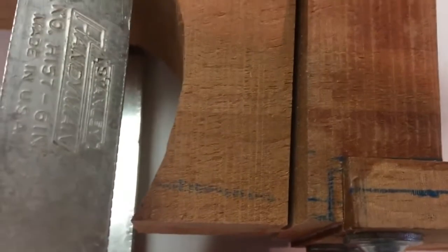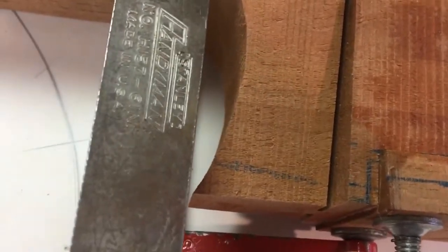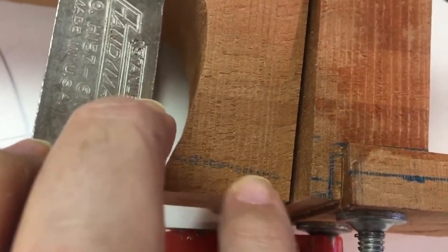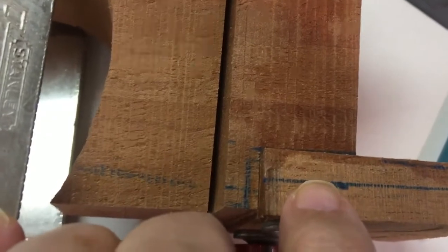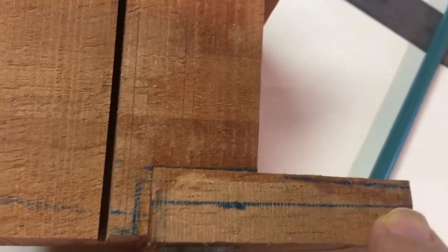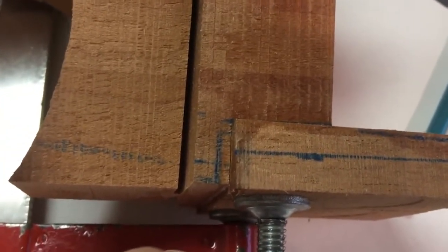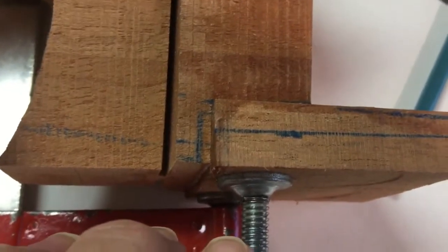What I did was just piece the inside rather than doing the outside here. That way it'll keep the same coloration and everything, but inside the heel, I'm using a real stiff piece of Spanish cedar, and I just inserted it this way, and then it'll come out like this. So this is a dilemma that got cured. A little harder way to work with a neck LMI sold me, but just the same, it works. So I thought I'd share this with you.